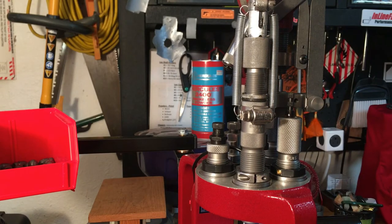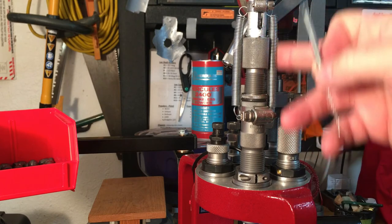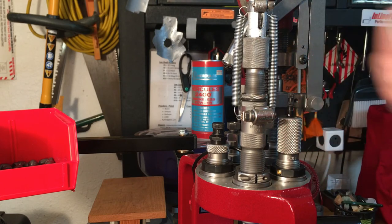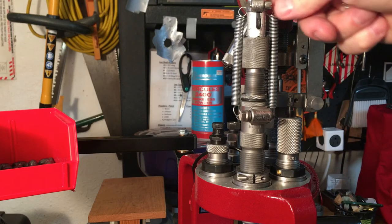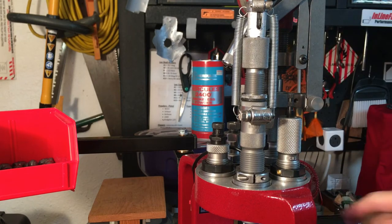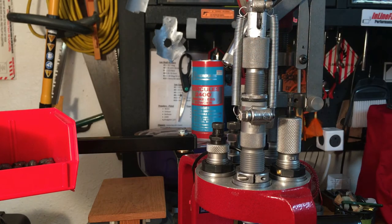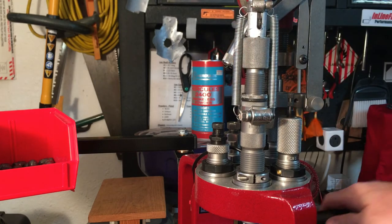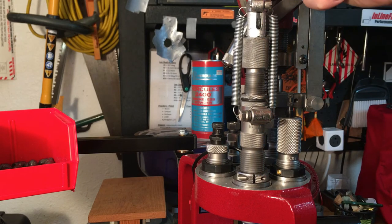If I try to pull this off by hand, that's not coming off accidentally — there's a lot of resistance there. My first attempt was to do it with just one spring on one side, and that worked reasonably well. But what I found, especially with a full tube, was a tendency for the tube — if I got some resistance or the brass pushed the bullets up just enough and caught the lip — it was flipping out to the right. Two springs prevent that.